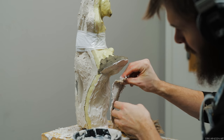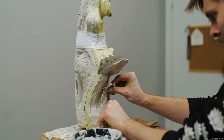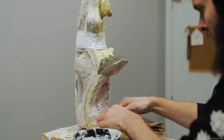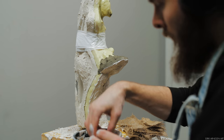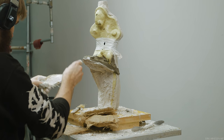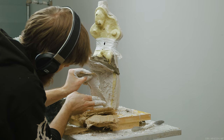A larger than 90 degree wall signifies that the piece of mother mold will come off first, and a less than 90 degree wall will usually come off last. There are exceptions and these rules don't always apply, but they're a safe and easy course of action that leaves you with a high chance of success and a low chance of failure, which is of course what we all strive for.